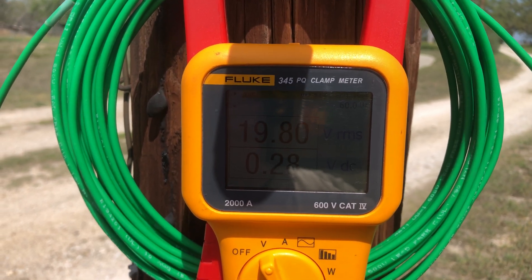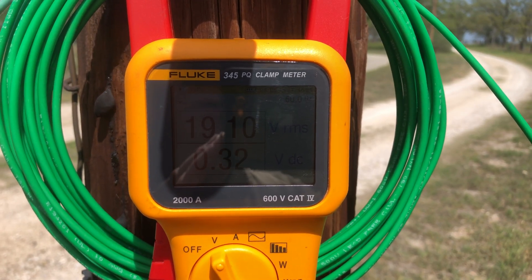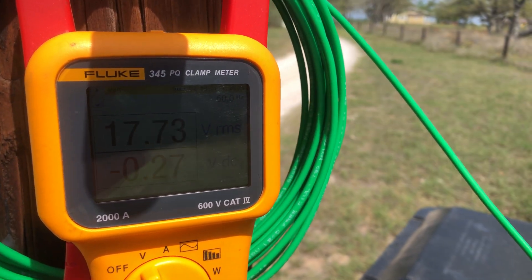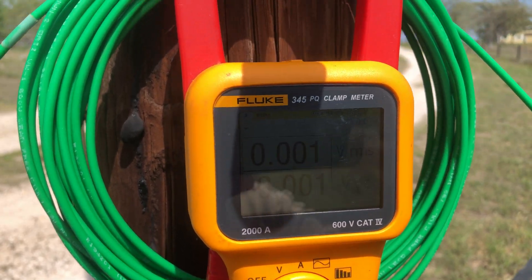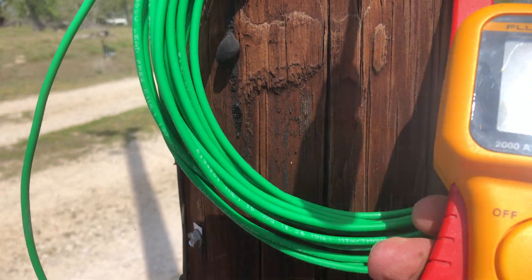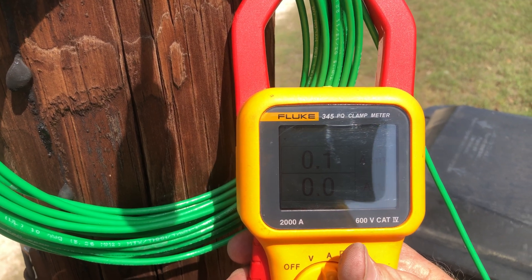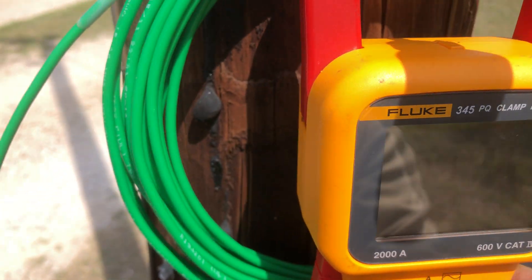Remove the 500-ohm resistor and I go to 20 volts. That 20 volts is not real. Now we're going to take a bonding jumper, put it on the fence where the voltmeter is. And because my voltage fell to zero, you can see that I have parallel paths. So we're going to go to amps and go around my coil. My coil says I'm dumping one amp. So you can get all crazy about that 20 volts measured between the utility and the fence, but it's all make believe — it's not real.